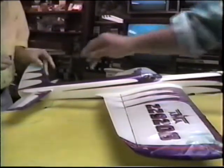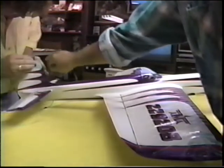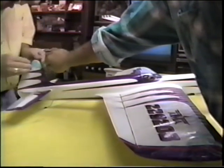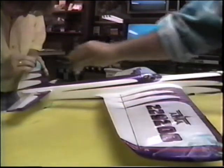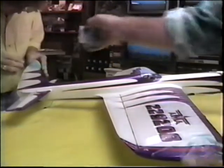Now, the other reason when Dave did this, to always put hot stuff on the raw wood, is you know eventually you're going to want to get the area wet. If you didn't put the hot stuff on the raw wood, and if you sand through into the raw wood, you want to wipe another coat of thin CA, make sure you're not into raw wood there. Because what will happen is when you go to prime that, wherever it sees raw wood, it's going to be a dry spot.